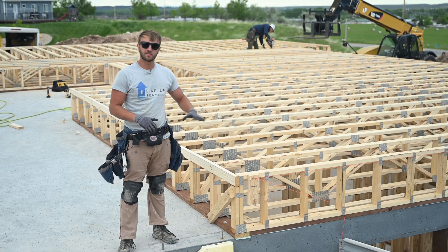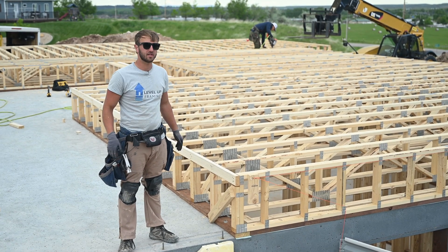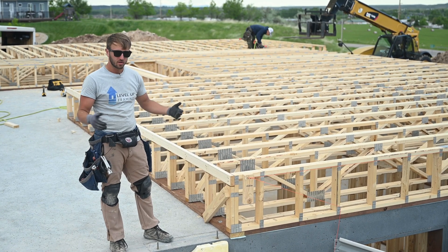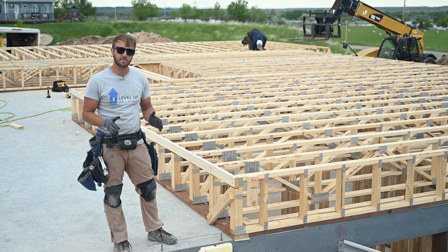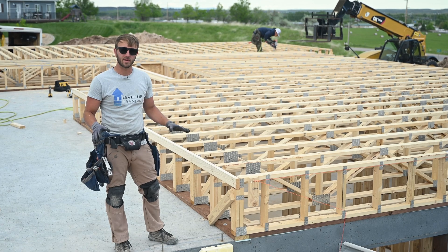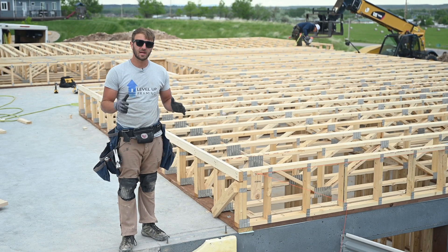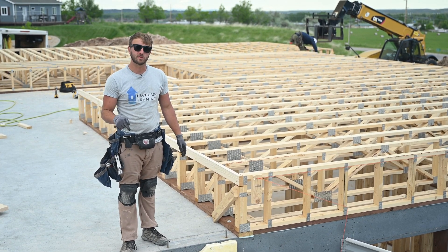We got our entire floor set. All the trusses are lined up real well on the sill plate. Our longest runs are what we flush to, and we went through and leveled the entire floor shimming where we had to. It takes a while to do this, but it really pays off for the rest of the framing and all of the subs that come after us. Up next, we're going to be sheeting the floor — click here to watch that video. And if you want to see an in-depth video on every single part of the house build, subscribe to our channel for more.